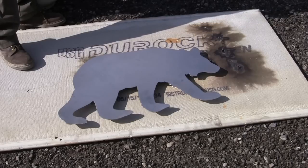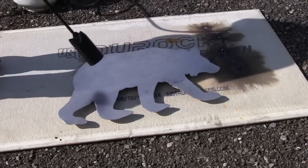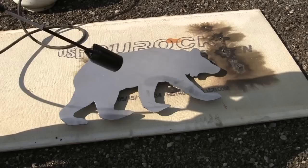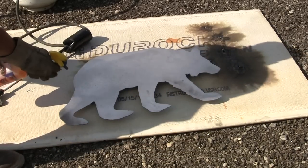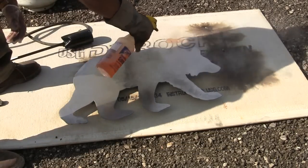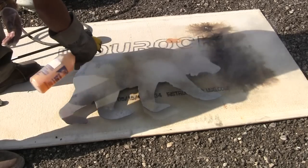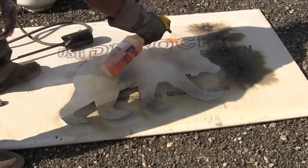This is my favorite part of the project. We're going to take a weed torch and heat up the metal. You heat up the metal because it takes the chemical better. So we're going to spray on a couple different patinas. These patinas will help change the color and give it some variations of browns, reds, and blacks.